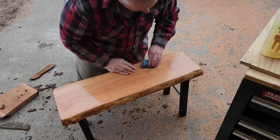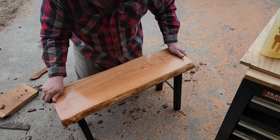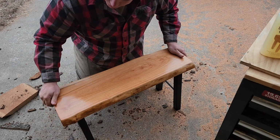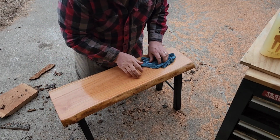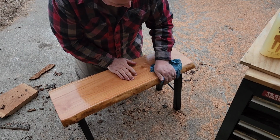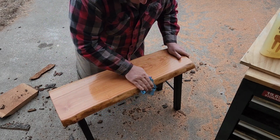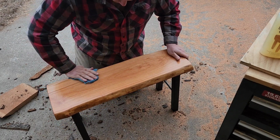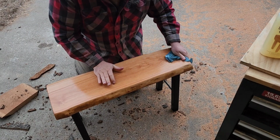Now this wood, I'm going to shock this wood. It is cold outside. As you can see, or maybe not see, there's snow in the background. When I bring this inside, it will want to sweat because it will have a thermal mass to it. And that shock right there, if it's going to move, that would be the time it'd probably move. But I do not foresee this moving because this has been cut for a rather long time and it has remained stable.